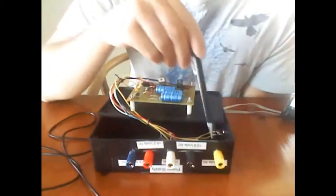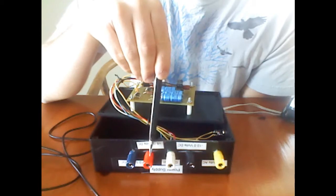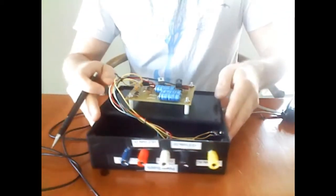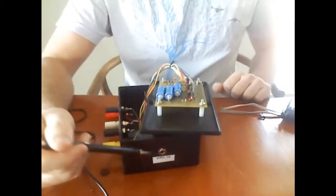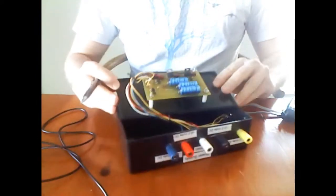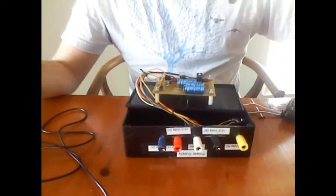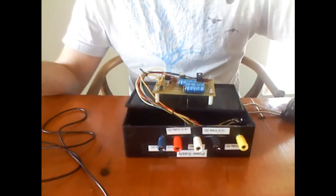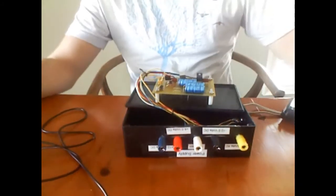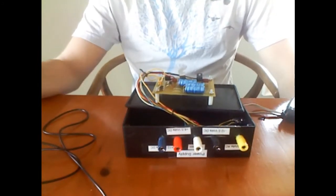The circuit has 12 volts AC, negative 12 volts, a ground, 5 volts positive DC, and 12 volts positive DC, and it's all being powered by an input transformer of 12 volts. There's a quick view of the circuit board when it's all put together. This is a really useful tool — I use it practically every day at school, and even when I'm not at school it's very functional. It's a nice little power supply, and if you're not from Mohawk College there are also going to be schematics so you can mimic this if you want to.